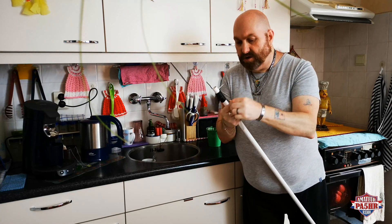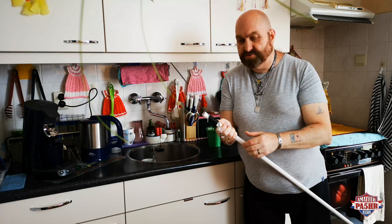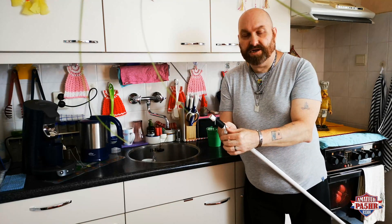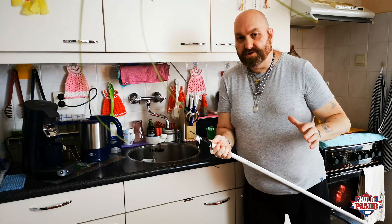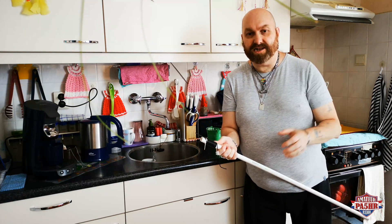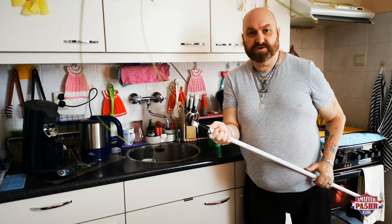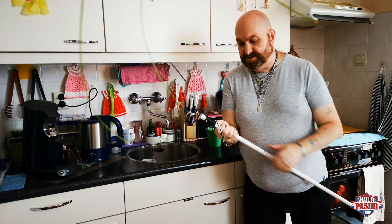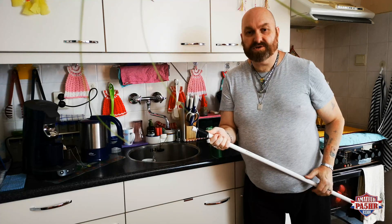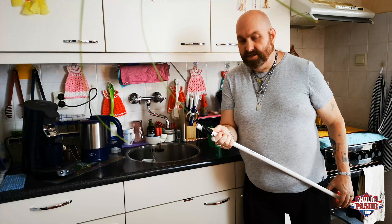You can wind the coil with copper wire. Here I'm using two and a half meters, so the antenna is electrically two times almost five meters. The whole antenna is five meters in total length, and with a coil you achieve two times five meters. That is my idea, and I hope the antenna will work a little bit, because I have not much space behind the house - that's the reason why I make this antenna a little bit shorter.